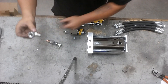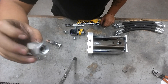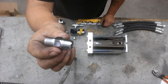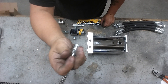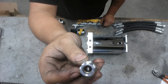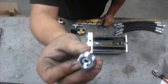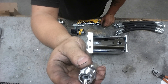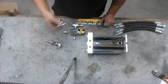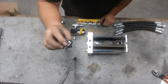In the kit you should have a 3/8 male to a 3/8 female live swivel. Then you're going to have a check valve — the check valve is 3/8, 3/8 pipe. Make sure you pay attention because the check valve has ball bearings. I can't stress this enough: make sure this ball bearing is put in the correct position. If you put it in the wrong way, it's going to either jam up your gear, blow an O-ring, blow seals, or possibly blow the gear off.